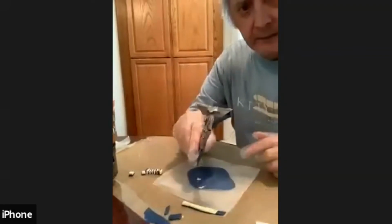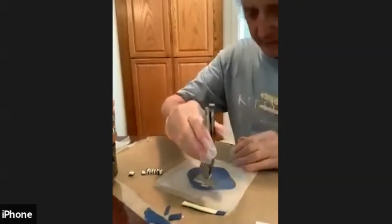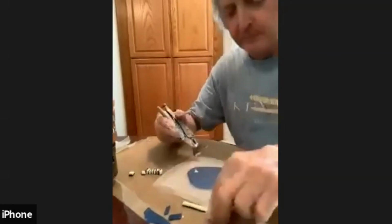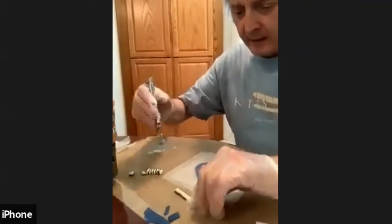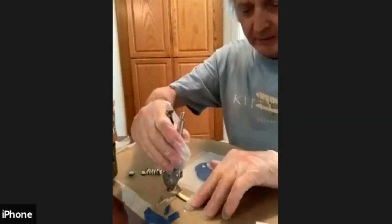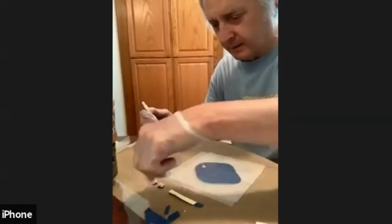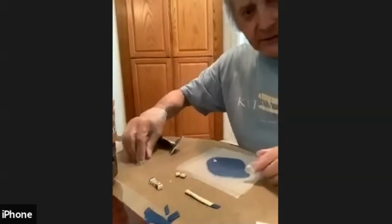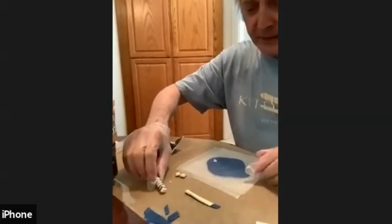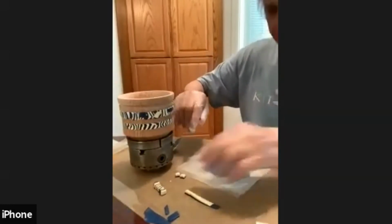And then I take the sheetrock blade, and then you'll cut lines through both of them, and you make these lines. And then I'll cut it in this way into little squares that you see here. And then I take all the little squares and you line them up, one right next to the other like that. You try to make it approximately the size of your groove, something like that.